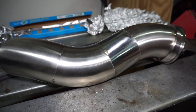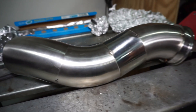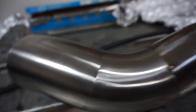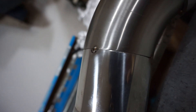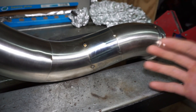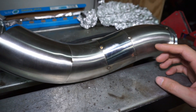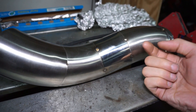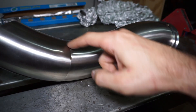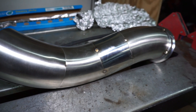First, let's talk about fitment. With any kind of TIG welding, fitment is going to be very important. If you look at the fit between these pieces, it's almost seamless — same over here, everything is really tight. You can weld over some small gaps, but it's a lot easier to blow a hole in it if there's a gap. And if you're not back purging, it's a lot easier to pull contaminants from the back side of the metal into the weld if there's a gap.